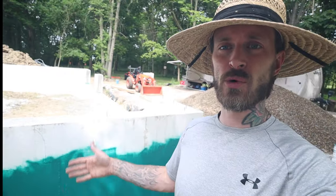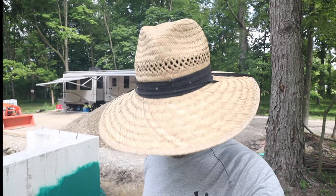And if you're dealing with cinder block or concrete, even if you do put rubber wall or another type of product on there, I really wouldn't want to put a below grade nail or fastener into concrete where water potentially could get to, rust that nail out, hurt the coating behind it, or bring rust right into your concrete foundation. You just put a whole bunch of penetration points of water through your foundation.